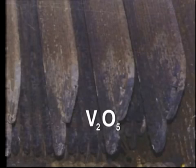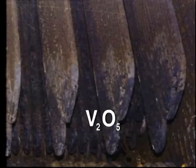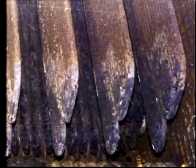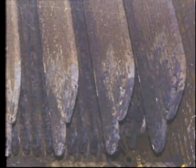Vanadium causes high-temperature corrosion in the superheater zone. At the high gas temperatures encountered in this zone, the vanadium becomes molten and mixes with excess oxygen to form vanadium pentoxide, indicated by the symbol V2O5. This molten compound runs down the superheater tubes and forms a hard deposit around the tubes. Worse yet, it causes external corrosion of the tube metal and also of the tube supports.